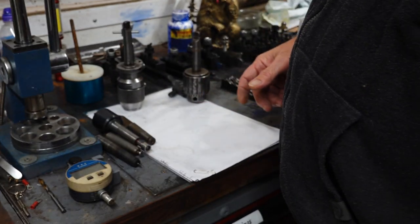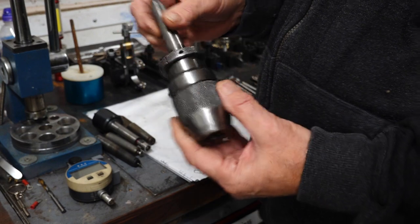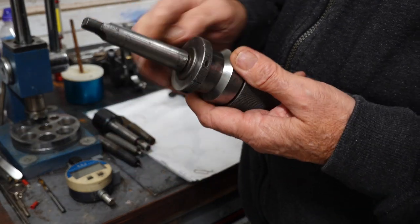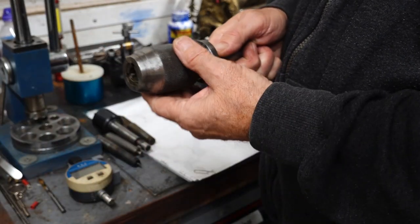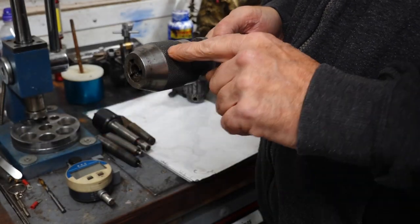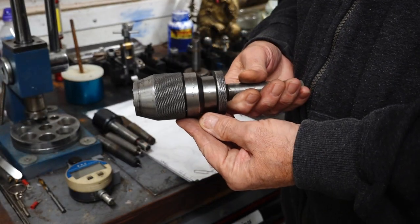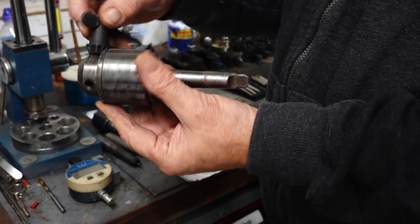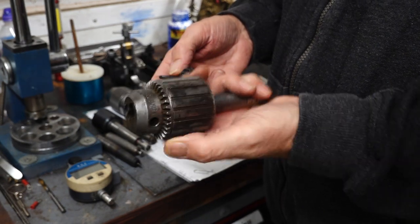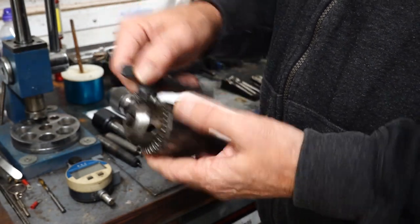You're also going to need a chuck for drilling holes in the end of pieces of work from time to time. This is my dedicated tailstock chuck - it's MT2 taper, an Albrecht keyless one which is great. But if you put a tap in there and reverse it, the chuck undoes itself and the tap falls out - just a warning. They are really good though, you can't beat the keyless chuck operated just by hand. I also have a Jacobs chuck with a key that I picked up at a car boot - it's rough and ready but accurate.